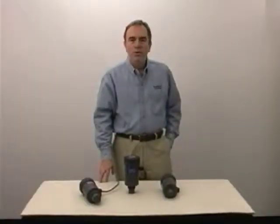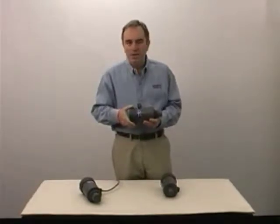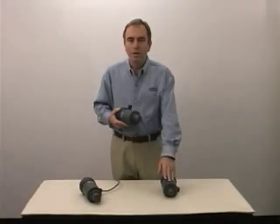Today I'd like to show you a new ultrasonic level transmitter. It's very cost effective and very simple to calibrate. The unit is completely made of PVC with a NEMA 4 housing. We have process connection sizes that range everywhere from 1 inch NPT up to 3 inches NPT.